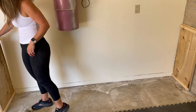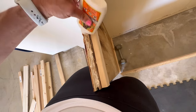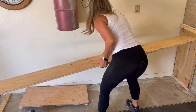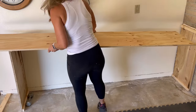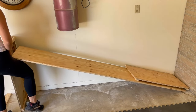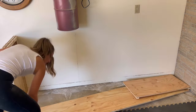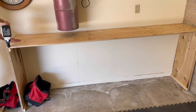Here I'm showing you that I cut one side at a bevel edge, but in hindsight since this is a painting project I would just cut straight across. For this next step it would be really helpful to have another set of hands to help put the top board across the two cleats on both side pieces. I was on a bit of a struggle bus but I got it done, then used brad nails and wood glue on the two top seams on either side to secure them.